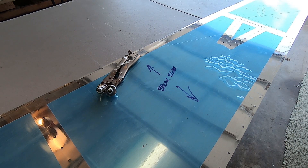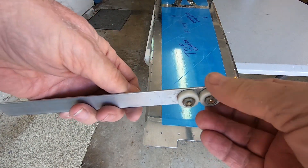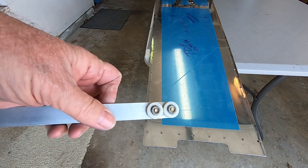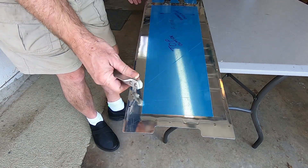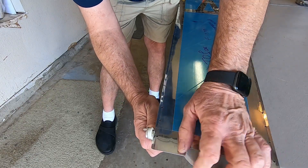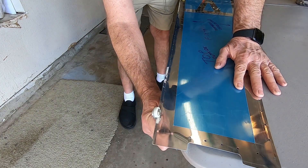Once again, I forgot to turn on the camera. Here's the top sheet with the edge broken using the Cleveland tool edge brake tool — I'll put a link in the comment section showing how to use the tool. I have a friend who built an RV6 and fashioned his own brake tool using two rollers from an old patio door bolted to a piece of aluminum angle. I used this to make the brake a little bigger — the additional brake has to go from here to here. A little bit spooky but it turned out fine.